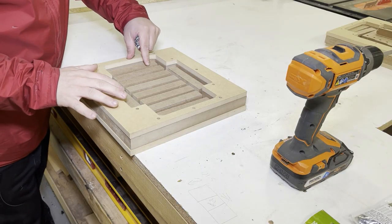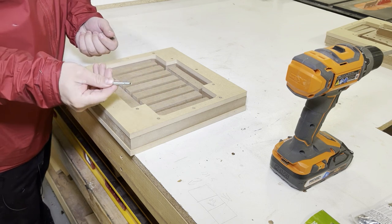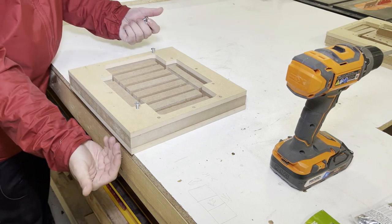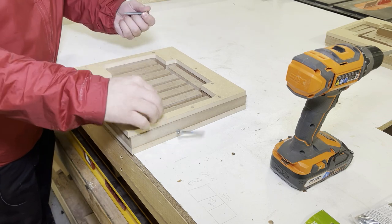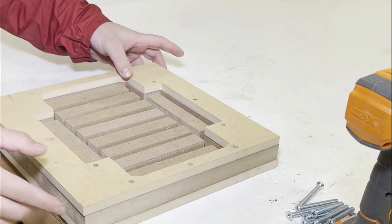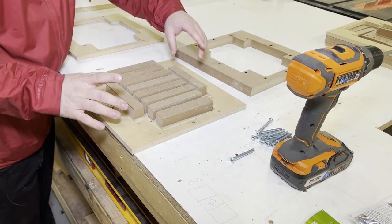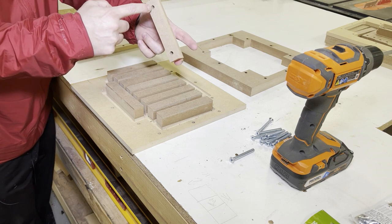Here's basically what it's going to look like when it's finished. These holes around the perimeter are just big enough for the bolts to go in so they'll index it — going in from the underside it will make everything line up on the inside. You'll notice this is a half-inch above that, so that's the bottom of the mold — think about it all upside down. Here's the very top of the mold, here's the middle part, and here are all the blanks. These holes are drilled big enough to put the threaded inserts in.